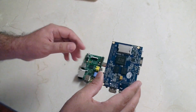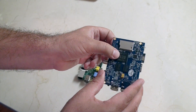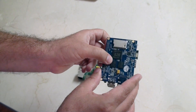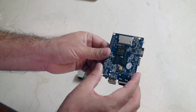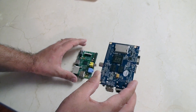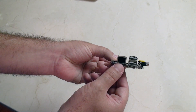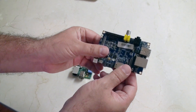The AllWinner chip uses ARM construction, but this is ARM v7 whereas the Raspberry Pi uses ARM v6 — a slight difference there. This is also a dual-core processor, so we'll talk about some benchmarks in a bit, but that is a significant upgrade. We've also doubled the RAM with two modules here, bringing it to a gigabyte. I think the most recent B+ revision really should have gone this way with a gig of RAM.